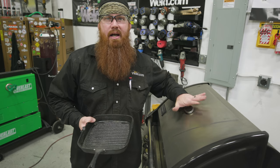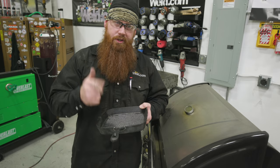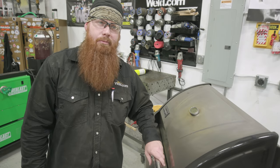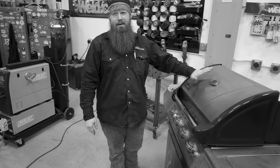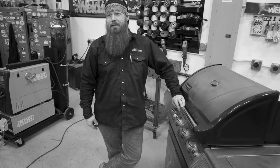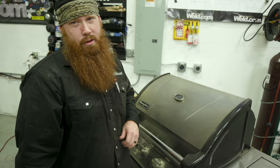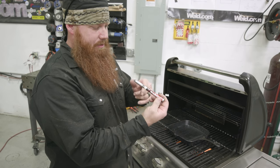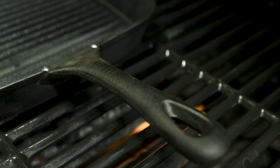I'm going to put it in this very highly sophisticated warming apparatus to get it up to 350 degrees, and I'll check that with a temp stick. At home you can use an oxyacetylene torch, map gas, propane, or even charcoal — I prefer propane and propane accessories. I'll give it about 10 to 15 minutes to make sure it gets up to about 350°F. The temp stick is from Tempil — you can get them on Amazon or from your local weld supplier. All you have to do is touch the material: if it melts, it's hit 350 or exceeded that temperature. There we go — 350.